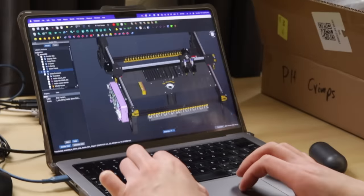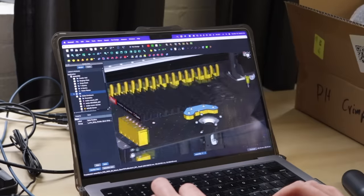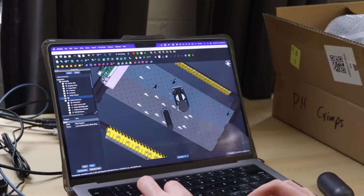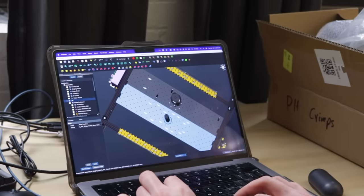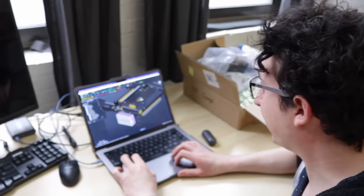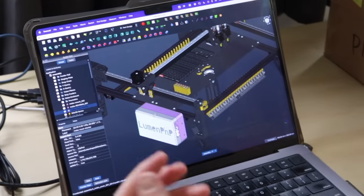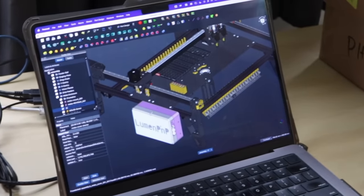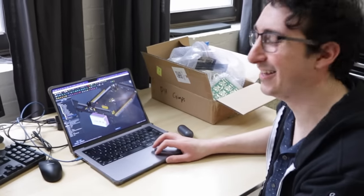We felt this was important because we wanted to be able to attach strip feeders wherever we felt like, which is really important for usability of the machine. You don't have to deal with rearranging stuff to find a place to mount your board — all these different wingnuts need to be able to land wherever you want. The staging plates take us around an hour to make right now, but by consolidating so much of the mounting into the electronics enclosure — no more valve mount, no more pump mounts — we're probably going to save around half an hour of building time. It's just going to be one big spicy print that has everything.